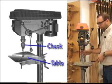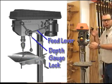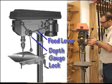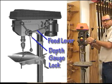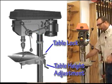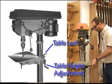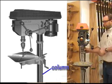You have a chuck, just like on the portable drills. You have a table. The way you make the drill come down is what they call a feed lever, and I can actually control with some accuracy how far down I come into the piece. This is called the depth gauge. On an older style drill it may be a threaded rod with a bolt on there. In the back you have a table lock — unlock that and you have the height adjustment handle, so you can set it to the proper height. When you're done, make sure you lock it back up. The drill press is supported by a column which supports the head and the motor.